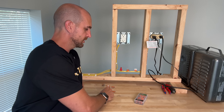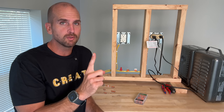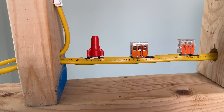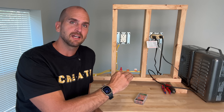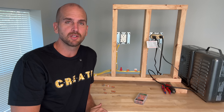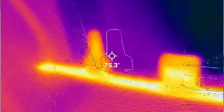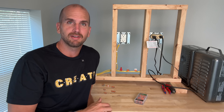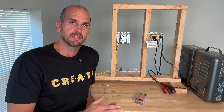But how do they actually compare? Let's look at some of the basic features and see if it's a one-to-one match. But more importantly, we'll put them to the test where I have a wire nut, WAGO lever nut, and these new lever nuts from Harbor Freight wired on the hot side. We'll run almost 30 amps through those and look at a FLIR thermal imaging camera to see the heat signature — is there any wire connector that gives off more heat, which would be indicative of higher resistance?